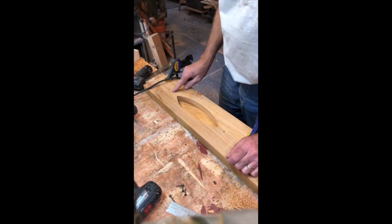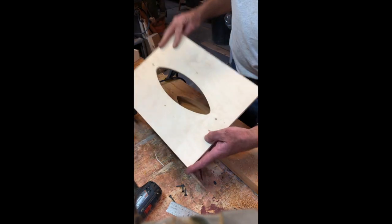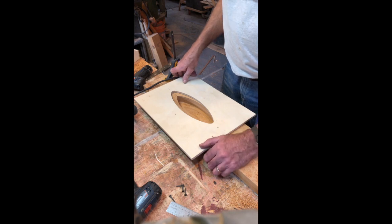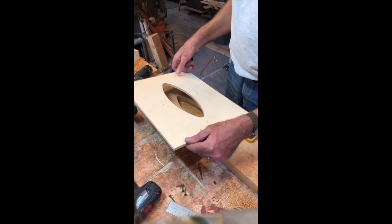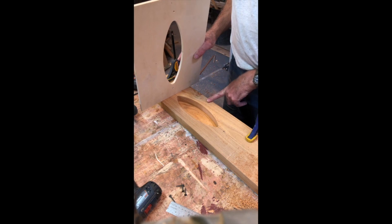And you're going to need to make some little plugs of some kind just to knock in the screw holes. That's just the cost of doing business. Sometimes with router patterns, if it's not as heavy of a cut as this, I'll use double stick tape and stick this on. In an exterior situation with rough sawn material, that's probably not going to work well, and not for long. And so I'm afraid you're probably just going to have to deal with some little plugs.